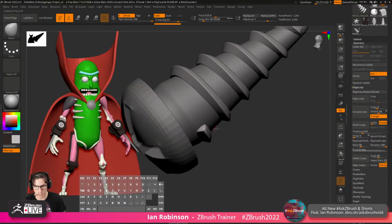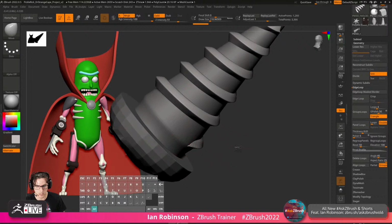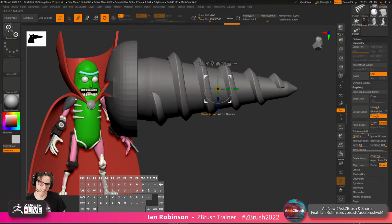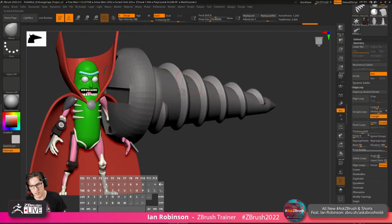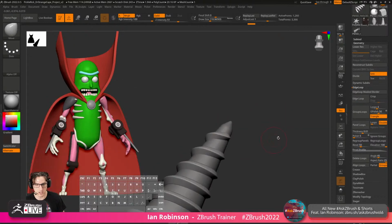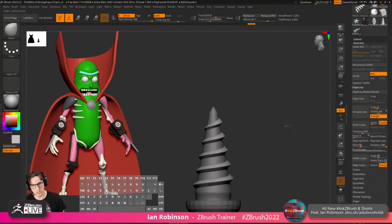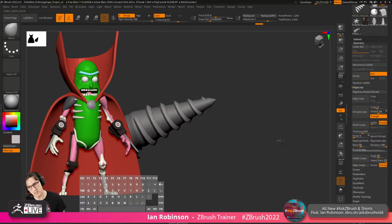And then I just want to tuck this one in, because if this was thread rolled or machined, it would actually be coming from the material. I used to work in manufacturing, so I used to make these screws all the time. So it'd actually be CNC'd or thread rolled, and thread rolling is really cool because they make a die, and then the metal comes in and it pushes the major and minor of the pitch relief in, and that gives us something like that. So it's either cut. This will be the high side of the metal, and this will be the low side, and they find the difference. So it'll be something like that.